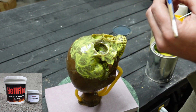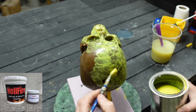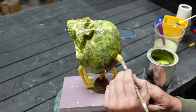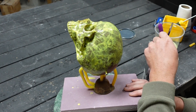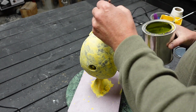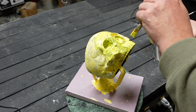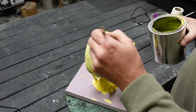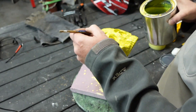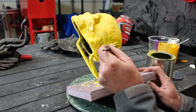This is the primer coat I'm using and it's very much the same as your suspended slurry. It works really well as it's a really hard shell. I just build up three to five layers on the primer — I kind of dab it on, getting a little thicker layer, and you want to make sure you cover your entire piece really well. I think this is the third coat now and it's turning out nice and thick.